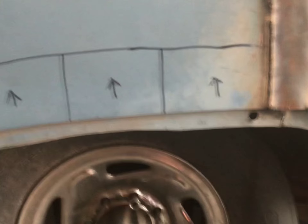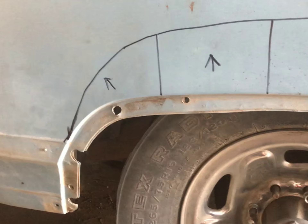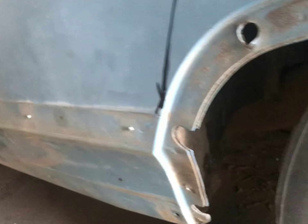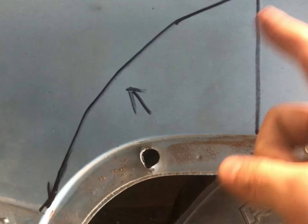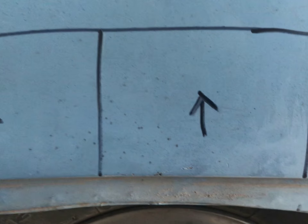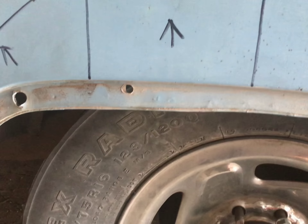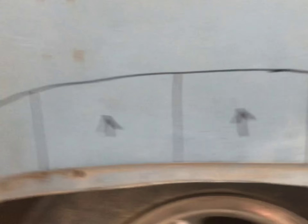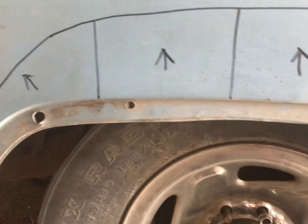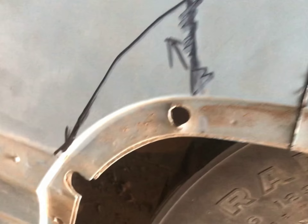I've got the passenger side marked the way that I'm going to fold and re-bolt these fenders. This little piece right here is just going to get hammered that direction. We're going to cut here and here, and then this will get folded up. Actually, I messed this up — I will remark these. Okay, we fixed our markings and went ahead and made our cuts.